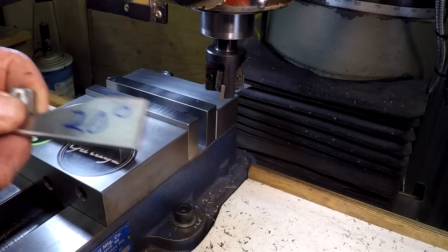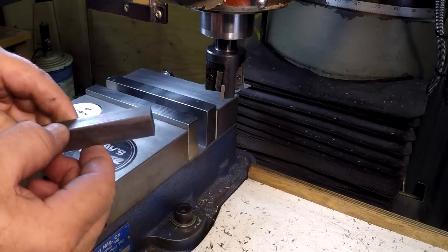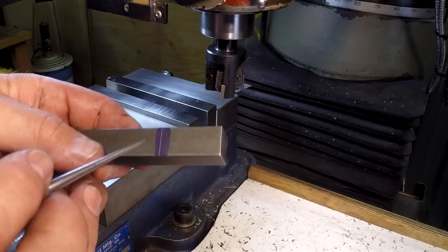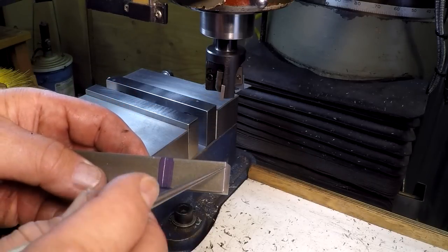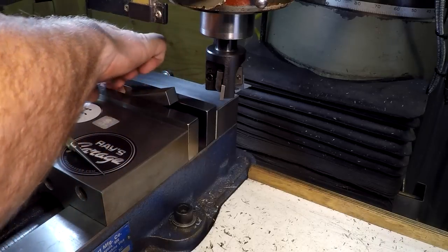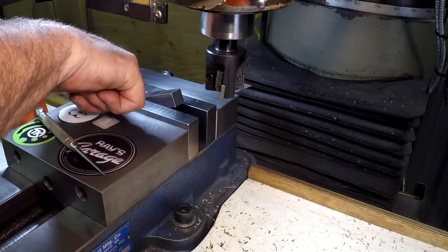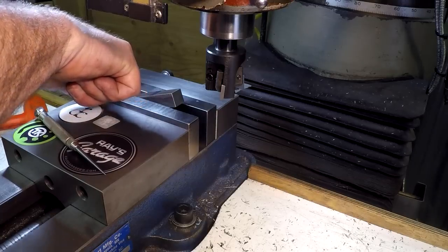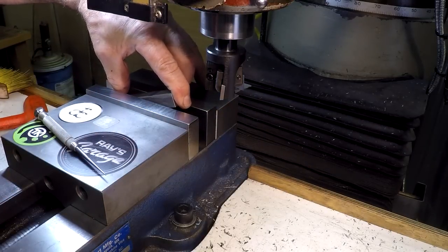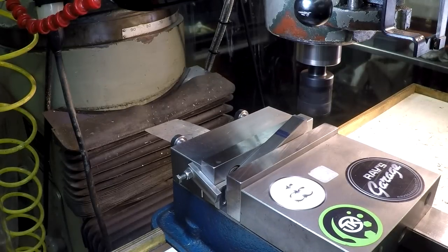Now I use my 20-degree angle block. I'll set it in there against the mill stop that's on the vise, and that's our 1 1/4 mark from the end. That will just mill to. Like I said, these don't need to be super precision. The angle of it is probably more important than how much. That just gives you the turning, so it can turn in the slot in the rail for locking.